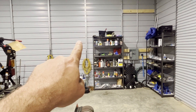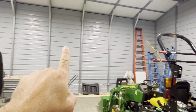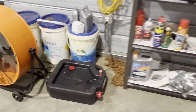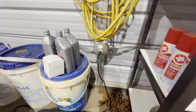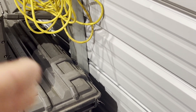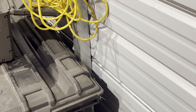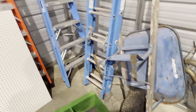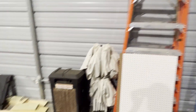For the outlets, I mount them to the posts and instead of mounting to the wall, I just bend it back into that little ridge. Every other post is skipped — on the skipped one, I put the half-inch EMT behind it, and it tucks in perfectly between the wall panel and the post. At the corners, I go behind the posts and do a 45-degree bend, go behind the other post, and then start again.